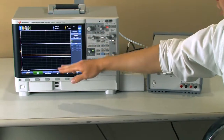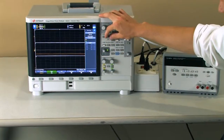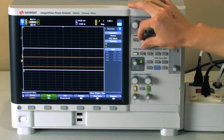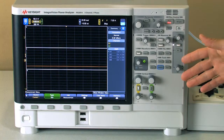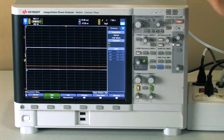Right now we have the voltage, current, and power, and what we're going to do is set up a trigger. I'll set it up here at 7 amps, so it'll trigger when the current goes above 7 amps, and it'll start when I press the single shot here, and then power on the DC power supply.